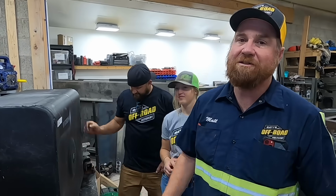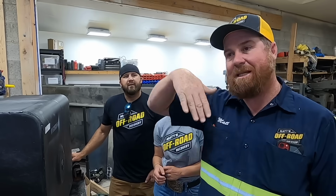What's the purpose of the sump? No running out of fuel? Yeah, what's the purpose of the sump? So this wrecker is going to be very dependent on the engine running to steer it and for brakes, and I don't want running out of fuel on crazy inclines to be the reason the motor stops. Engine for those of you in Rio Linda.